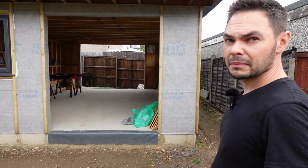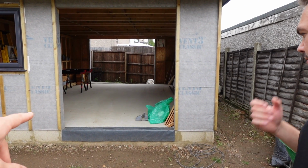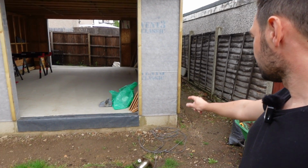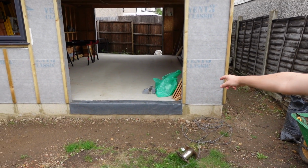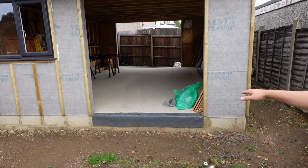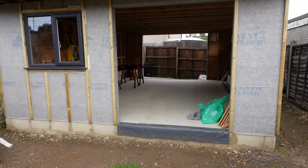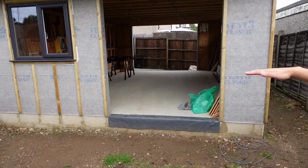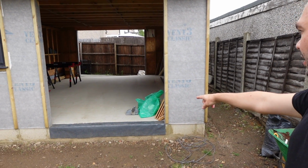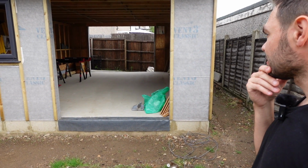So did you do trench foundation, block work, and then also do a reinforced concrete pad on top? Yeah, so what we did up to the block work and the sub base, and then we paused there last October. And then we were like, we'll put a lid on it for the winter, come back in the spring, and did the sub base properly, membrane, reinforce and insulate. We managed to dump in a little bit of insulation under the slab, and then poured that in March, early April, maybe something like that.